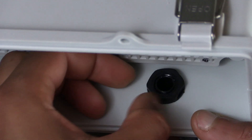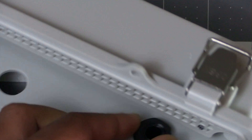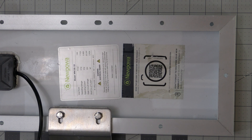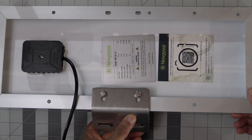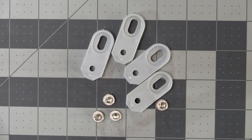Insert the NPT fitting into the hole and secure it in place. Now while we have the drill out, let's drill the remaining three holes on the back of the solar panel using a 15/64ths drill bit. The solar panel comes with a mounting bracket that gets mounted at the bottom center, with the black box and wires coming out on the left.